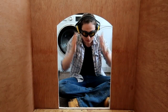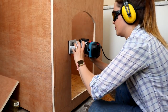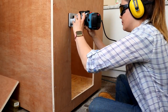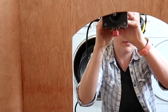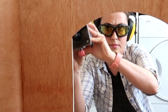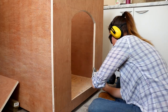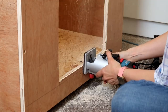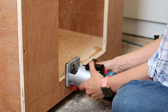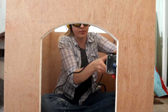It was chucking it down outside and I had to bring this into my conservatory because I hadn't treated it yet, then created a curved edge with the Erbauer palm router — the only tool I needed to plug in. A little tip I recommend: sand the jigsaw edge down first, which I didn't do, and then route over a straighter edge. But I knew that after sanding and painting it would all look fine in the end. I also smoothed it from behind because I didn't like the idea of it catching on Hans's fur.